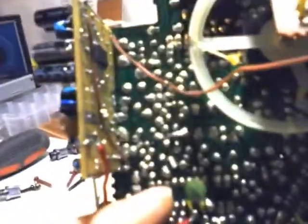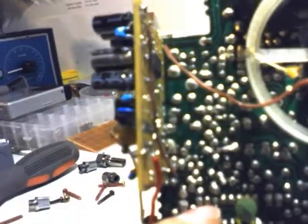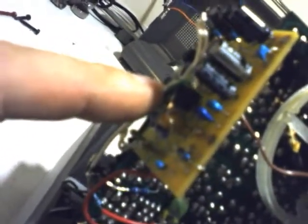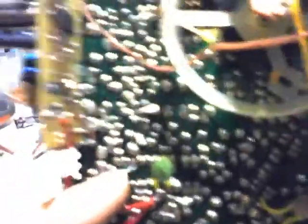The chip is controlled by the existing AM radio chip, which is under that little piece of metal there. When you switch from AM to FM, a voltage goes into what I think is the third pin. The 4016 just bypasses the stereo board altogether on FM. As soon as you switch to AM, the voltage appears on that pin and it flicks the internal switch of the chip so that it's now feeding the output of the AM stereo board to the input of the amp.